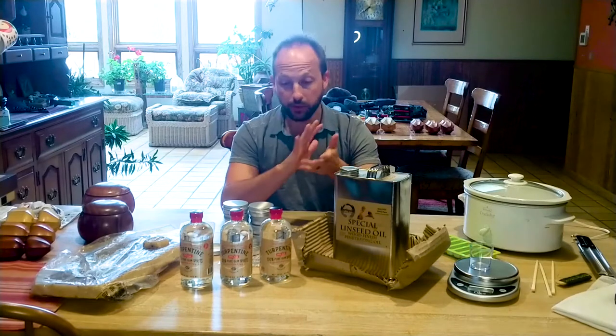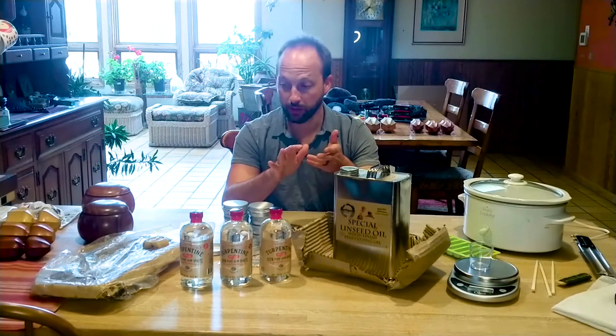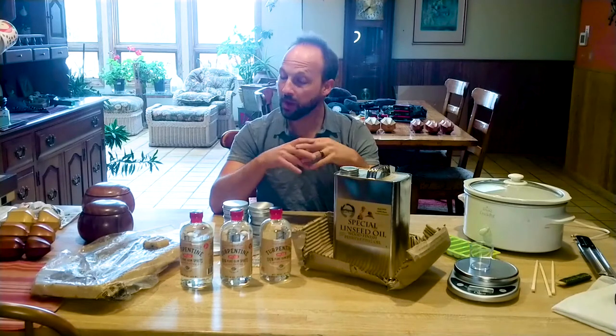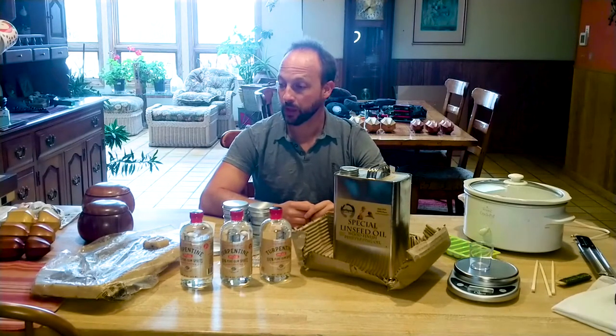You take flax seeds, you squeeze them, and you get flax oil. That's raw linseed oil, and you can use that with bare hands without ill effect. And it does take a long time to cure. So that's one issue, is that it takes about a week to finish its polymerization process. It might feel dry after a day or two, but it hasn't finished curing probably for at least a week, maybe more depending on the conditions you're in.